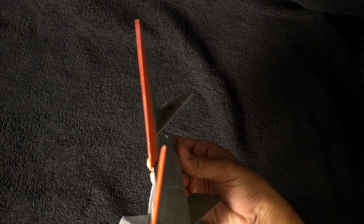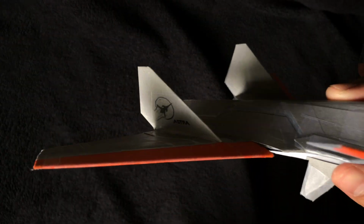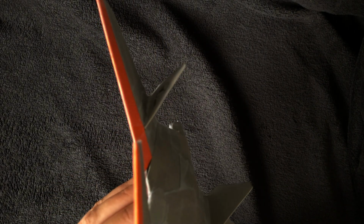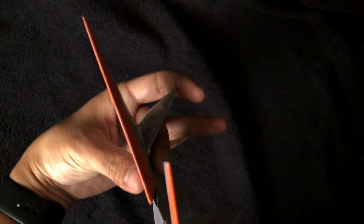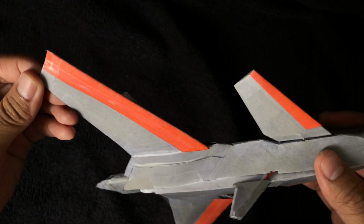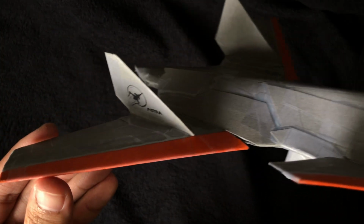Its planform tapers as well as its thickness. And so if you look at it from the side, taking some cues from some of my rapid prototypes, I was able to create a dihedral, and it might be kind of hard to see it here, but the thickness also tapers in addition to that. And that is also partly due to the leading edge slats, which improve stall performance.